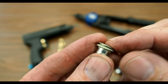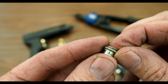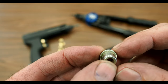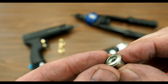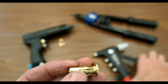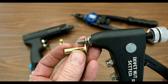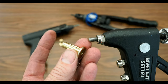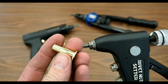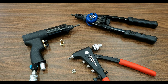What you end up with is a compressed insert. With no sheet metal in it, you can see it kind of pulled a little bit crooked here, but normally it would pull up tight right to the sheet metal. You can see the RivetNuts have a pretty limited ability to grab the sheet metal — there's just not a lot of surface area there. Now on a PlusNut, it takes a little different tool. One of the things about a PlusNut versus a RivetNut is the mandrels are not as long. You can see I'm going to need a considerably longer mandrel here to reach the threads of this PlusNut. Plus, since this is thicker metal, it takes quite a bit more effort to compress this versus a RivetNut. This tool does not have enough leverage to properly compress a PlusNut.